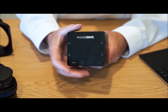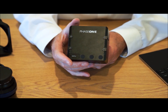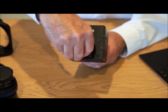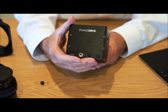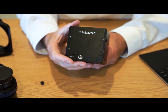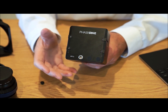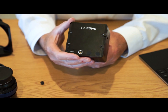As far as the connections, everything is sealed. It has a very high IP rating for weather — humidity and light rain. There are three Lemo connectors here that have rubber caps on them. You have power and then two control Lemo connectors. The reason there are two is that if you need several cameras all doing a mosaic, you can have them all daisy chained, with the first camera controlling the others.